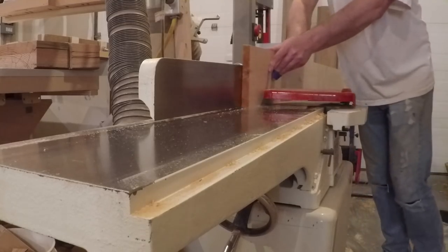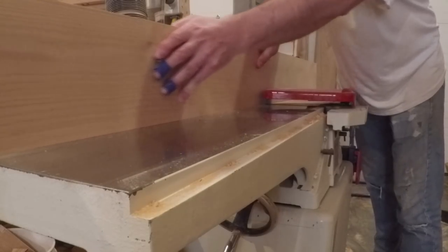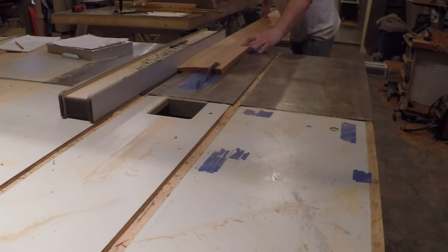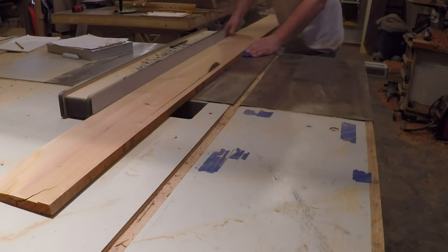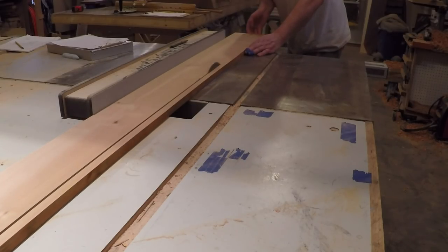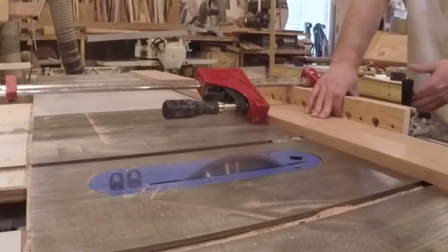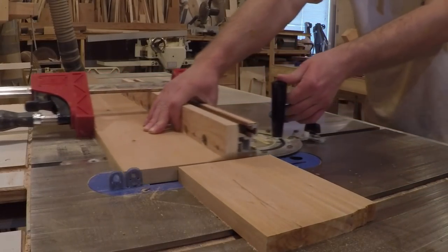The headboard is almost done except for the floating shelf and sheepskin, but I'll come back to that towards the end of the build. Right now I'm jointing and milling up some four-quarter alder for the frame that supports the mattress. These are going to be attached to the side skirt boards and foot board. I ripped them just tall enough so they would accept the knockdown hardware and sit just below the walnut platform to hold the mattress in place, then cut them to length, clamping them to the miter gauge to ensure a nice straight cut.